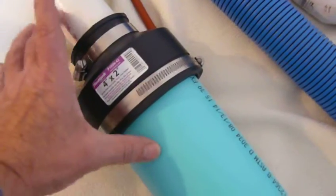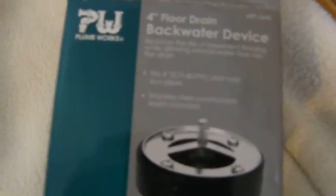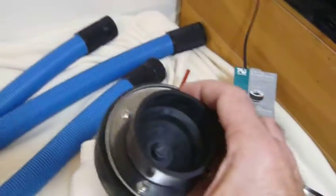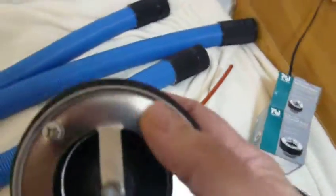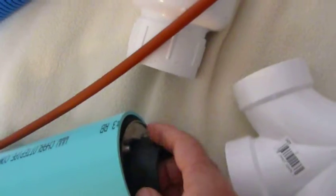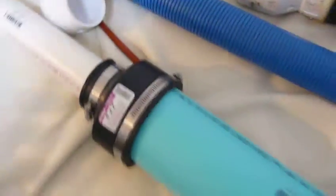This is a four-by-two coupler made out of rubber with two band clamps. You tighten these and it will hold very securely. This here is a backwater drain device — this is where the air escapes. It's spring loaded and compresses by these screws here. You set it in here and it will fit pretty snug if you tighten those screws appropriately. Then you put it in this coupler and you'll have a setup like this.